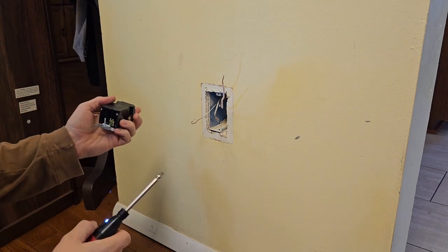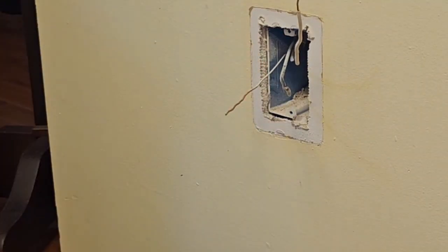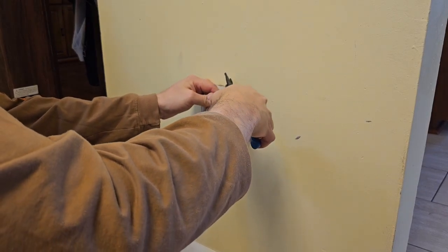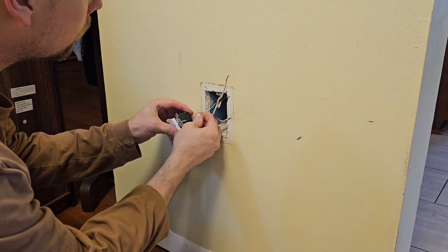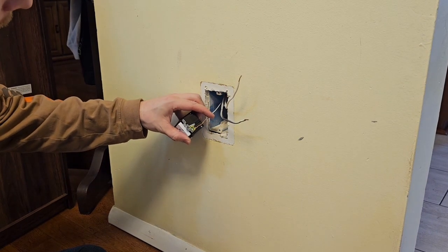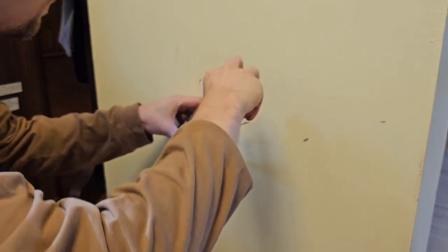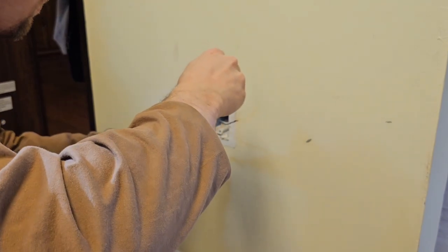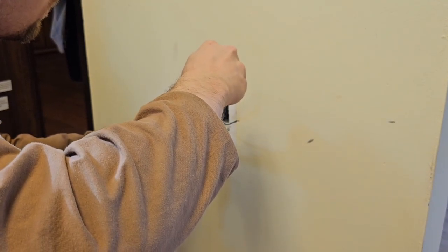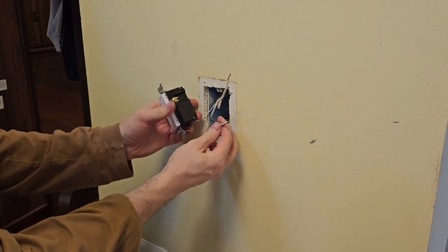I really like this particular one because you don't have to use shepherd's hooks on any of the wires. You just need to bend them straight, leave about a half inch of wire, and that wire is going to go straight under a flat plate. To remember which colors go under which screw: white goes to light because it's just right; black goes to gold, or so I've been told; green to ground because the world is round.